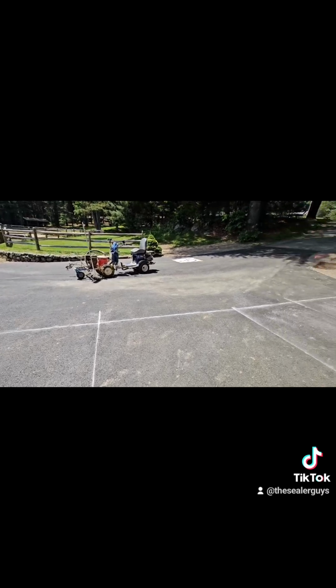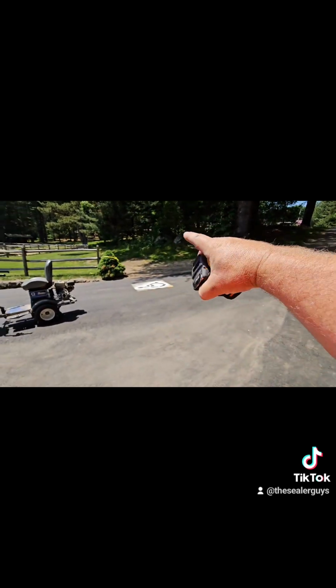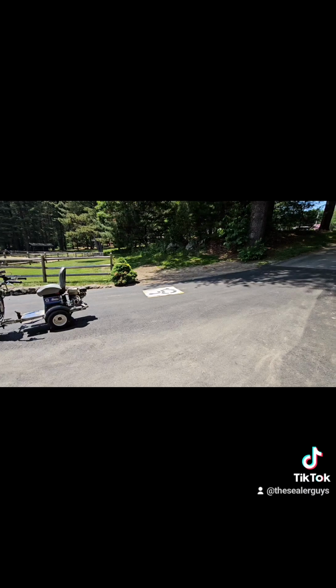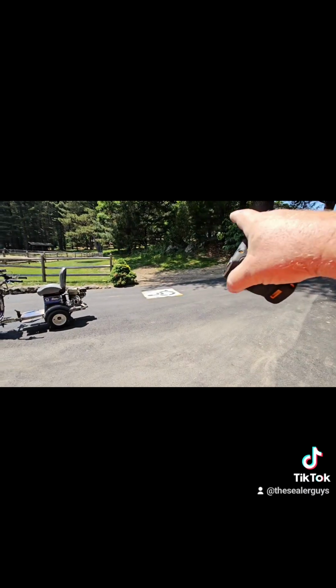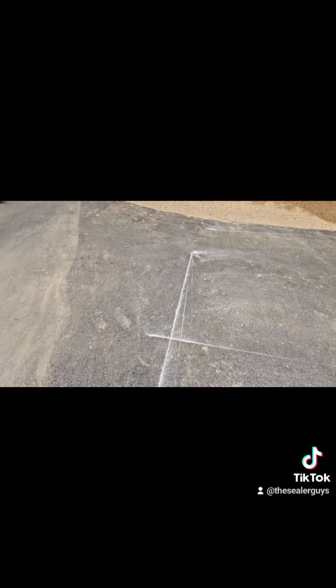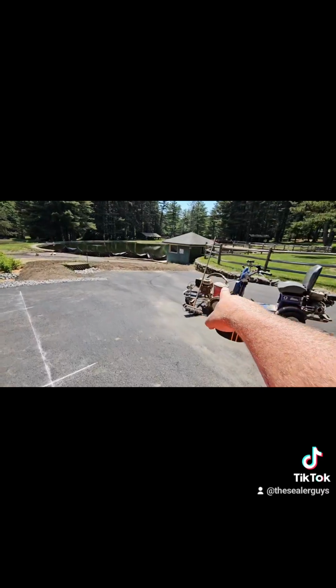Okay, so on our plan, we have 2 measurements. One is supposed to pull right off of there a little bit. It's supposed to actually kind of kick in before that bush. But this edge isn't the same as it is on the plan. So anyways, I pull my edge on this right here. I come over 24 feet. That's where this mark right here comes from. Then I have another mark over here that's coming off of this stone wall. That comes out 26 feet 7 inches, and my mark for that is at the tip of my toe under this white line.